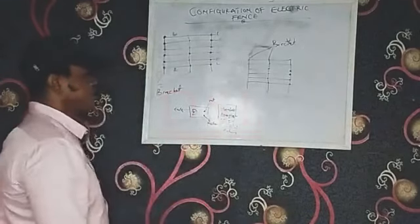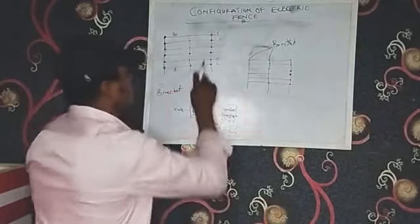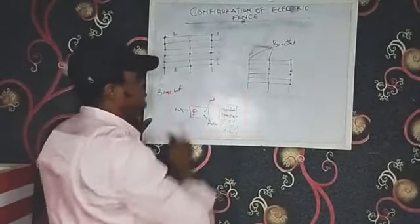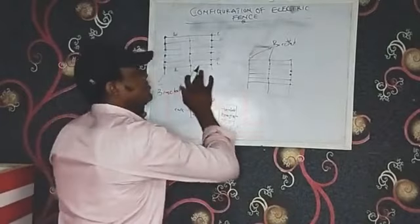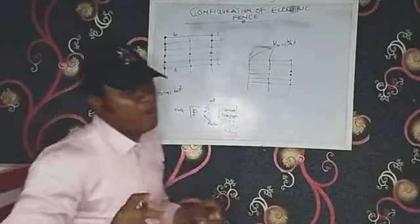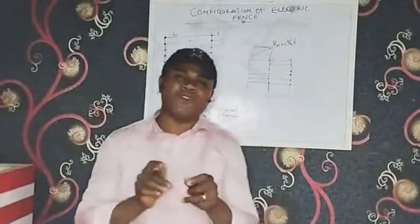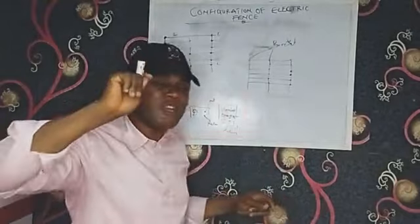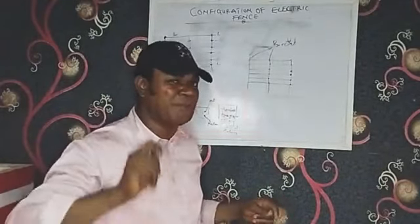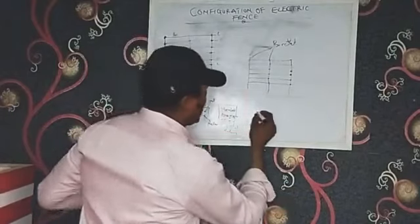So how do we look at this? For example, this energizer, I'm going to connect this energizer to this fence. Now I need to link this fence with this, where I have a single loop. And I want you to understand today that the electric fence principle is based on a single loop line. What do I mean by a single loop line? It's just a line, this kind of line.